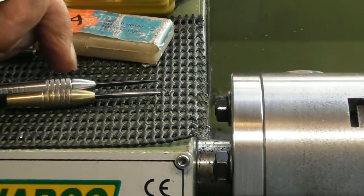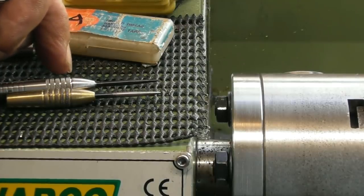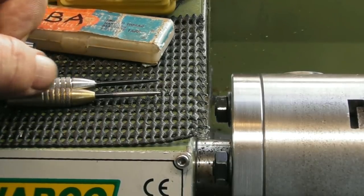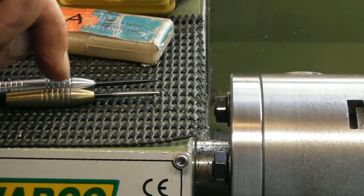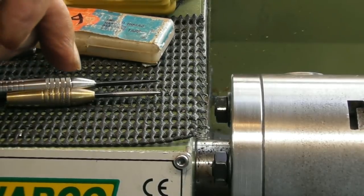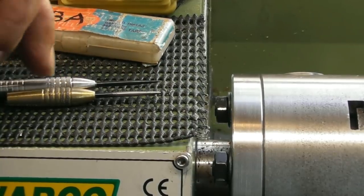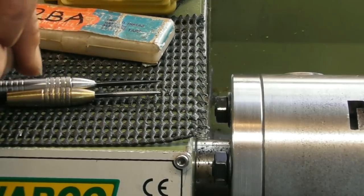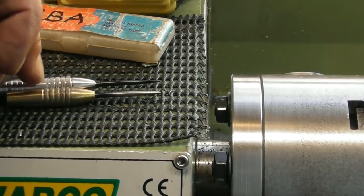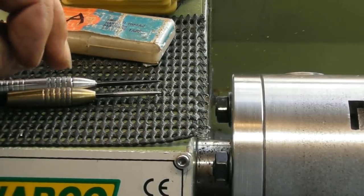Off camera I've just taken the three darts and used a V-tool with normal carbide tips — not the aluminium ones I'd been using — which has exactly the same radius as the root of the grooves in the existing dart. The distance from the very front was 10.2mm to the first groove. So I've taken all three darts and put the first groove in at 10.2mm. Now there are a series of six grooves, and the overall distance from the first one to the last one is 11mm. So I've got five steps at 11mm, meaning the groove spacing is 2.2mm between each groove.